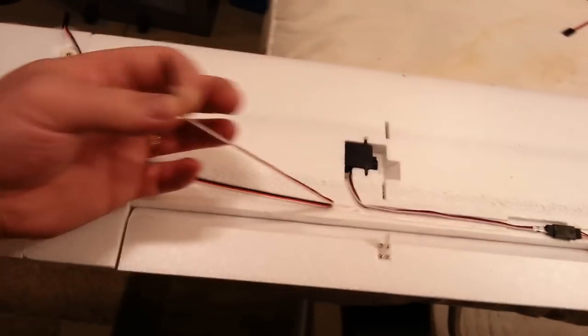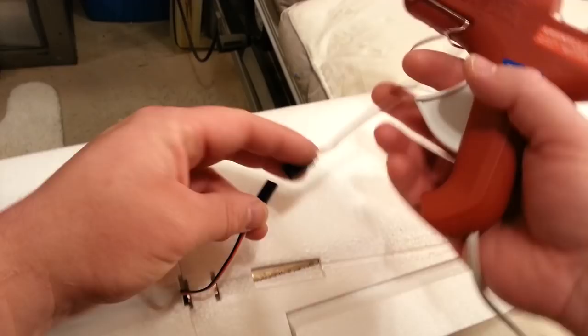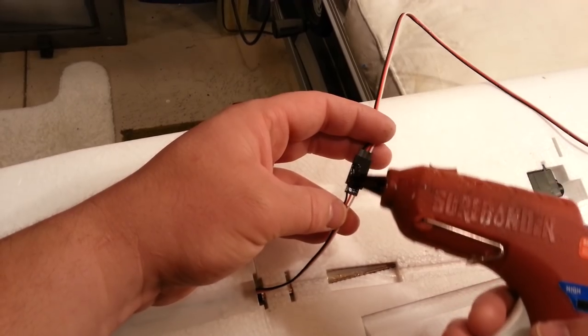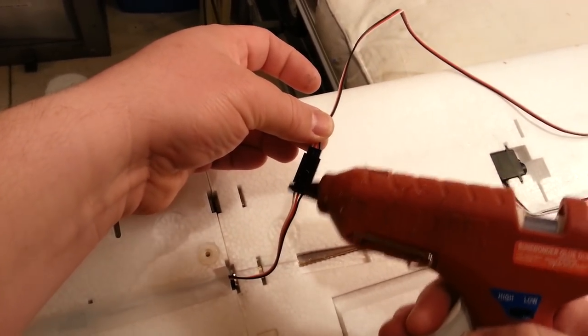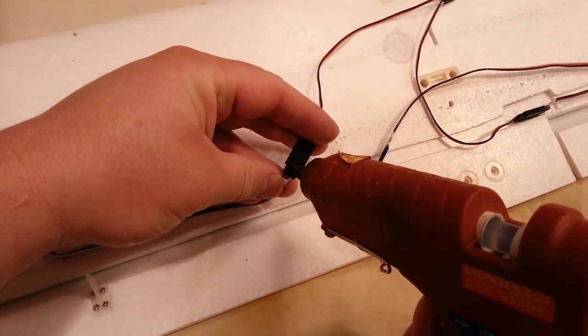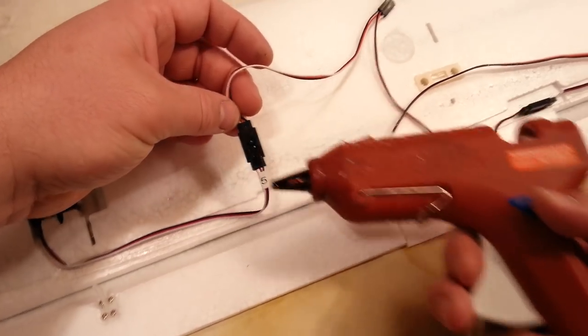This one here we'll peel up as well — it's just an extension cord. I don't care that much about the color since we're going to make a label anyway. Black to black, white to white — that ensures signal goes to signal and ground goes to ground. Power goes to power no matter what since it's in the center. Just a little bit of hot glue on all connections.